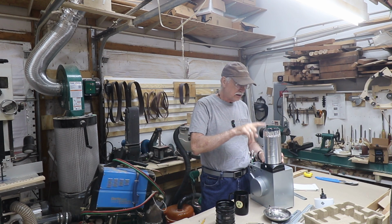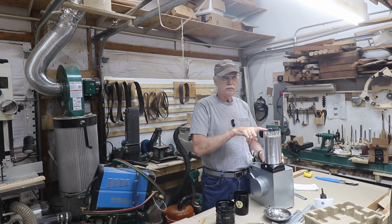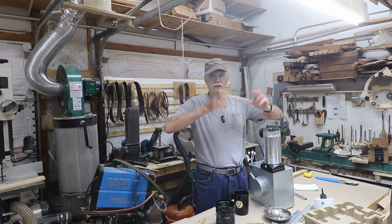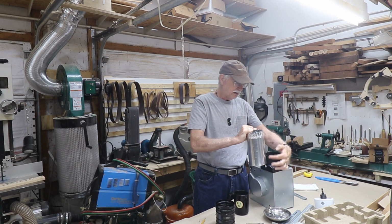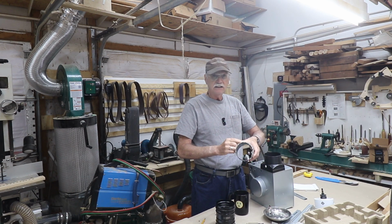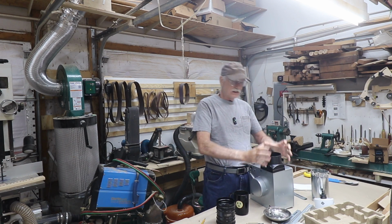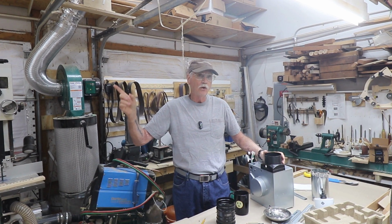So the first thing to do is to cut this ductwork. Now, I cut small pieces of ductwork with an angle grinder. I don't use the tin snips because it's really hard to do in a small piece like this. What I typically do, I'm not going to show you this, is clamp the grinder in my vise, take the piece and just roll it into it like this to get the shape that I want. I've got to measure from here to here, and then measure how much I want to leave on here for this. So let me get busy with that, and I'll put this thing kind of together. Then we'll go whack a hole in the ceiling. A bigger hole in the ceiling.